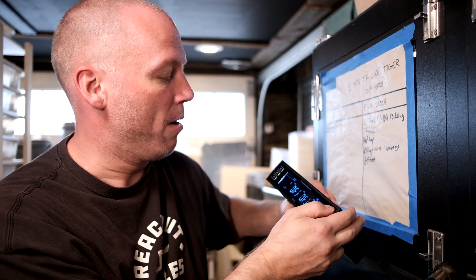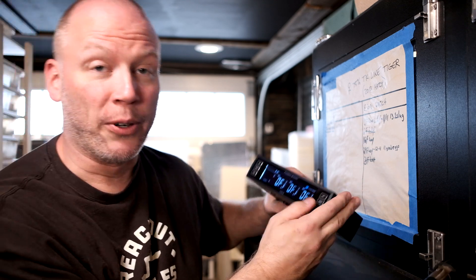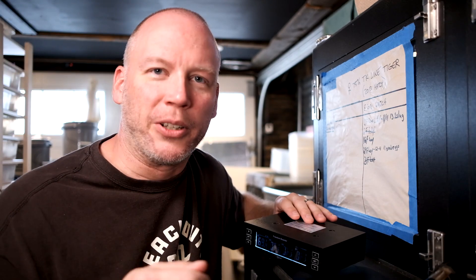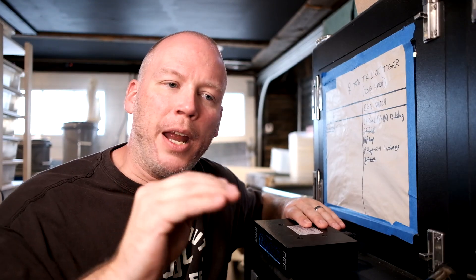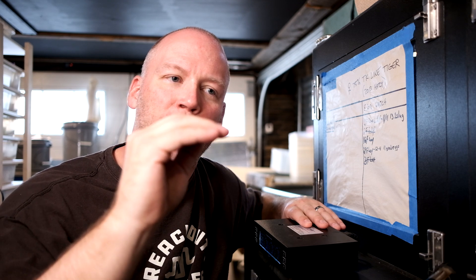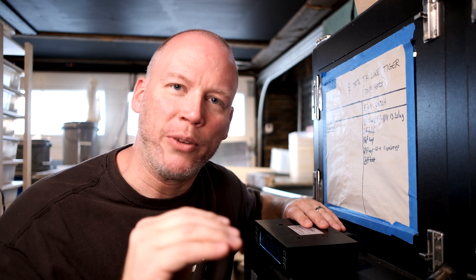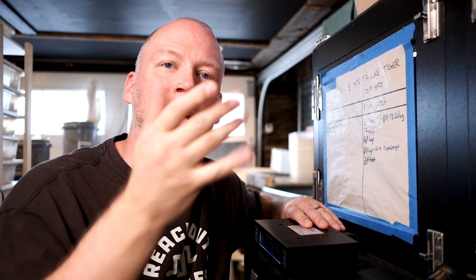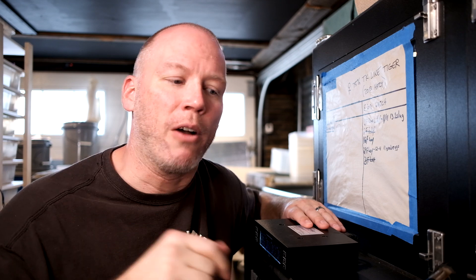Next setting is your nighttime drop — there is not going to be a nighttime drop. You're going to set this at 88.0 as well. The next setting is going to be your difference, and your difference is 0.5 degrees. That means that if you set it at 88, it heats up to 88, shuts off, then starts to fall and hits 87.5 — boom, it kicks back on. It comes back up to 88, and it might go a little bit higher, but it's going to maintain that half degree in between there.